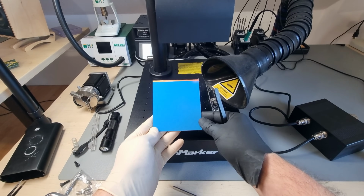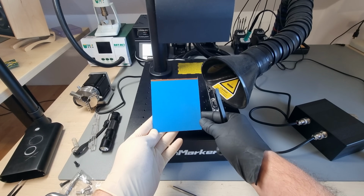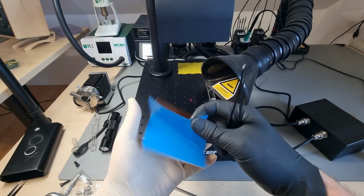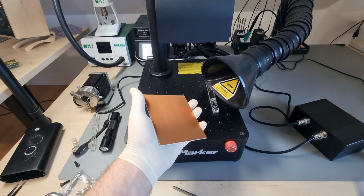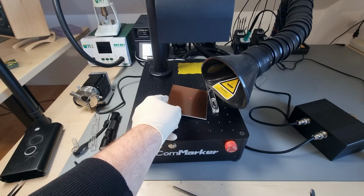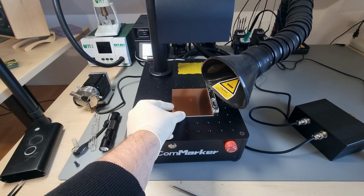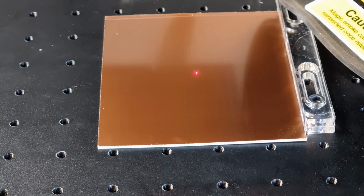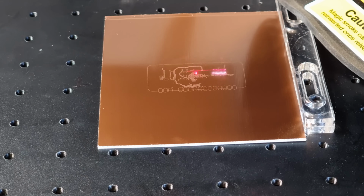I know what you all crave. Will it circuit board? This is a photosensitive pre-coated Bungard FR4 board. It seems to be some kind of German specialty because whenever I'm using these I get tons of questions. Basically, when you are preparing for chemical etching, you can simply spray some copper-clad material with a spray paint rattle can, and then remove the coating with a laser wherever you want the copper gone.